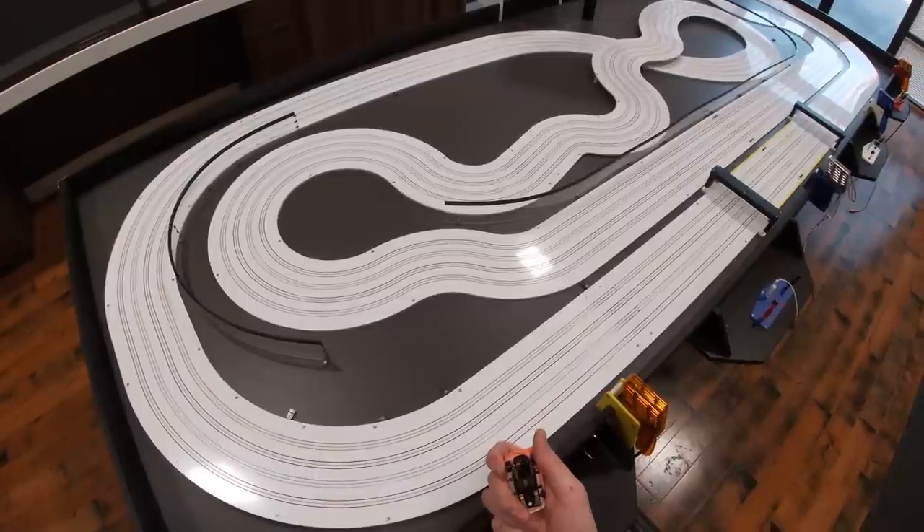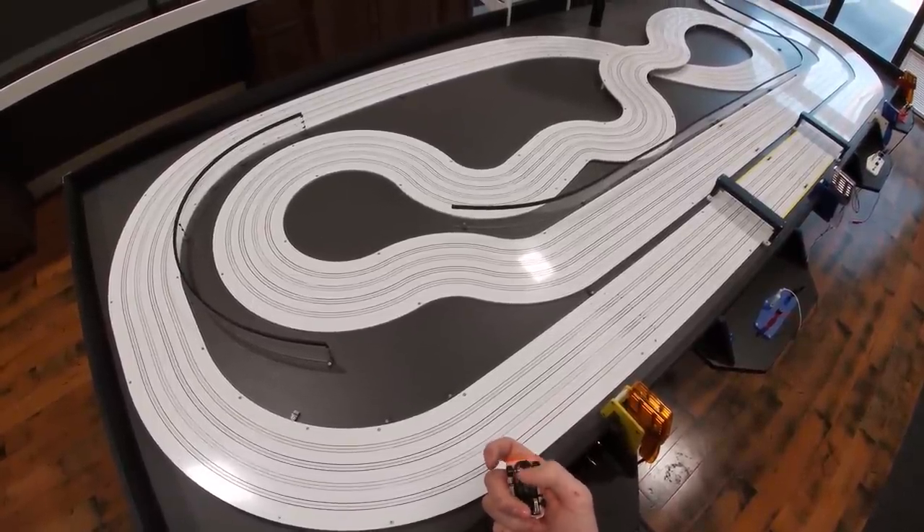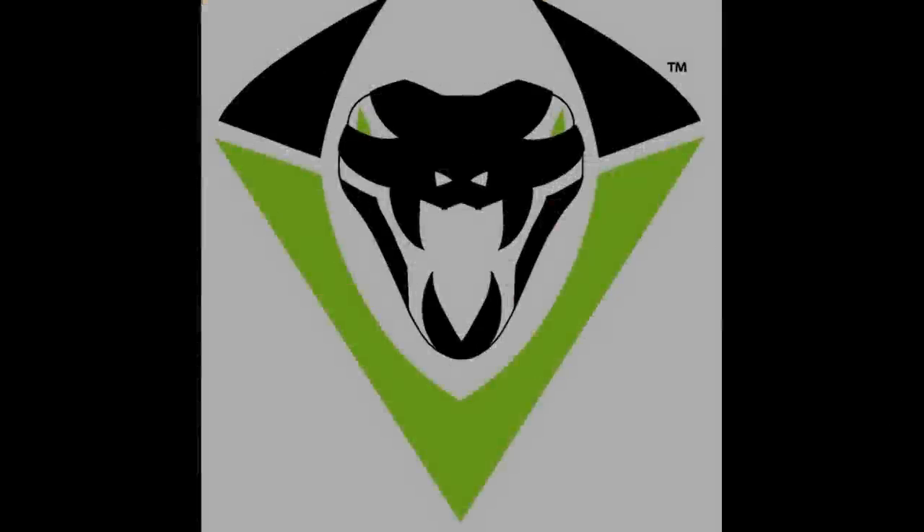These cars start at $49.99 without the body and they're built to spec just like we did here today. That's it for the video. Wrapping up: today we built a 12-volt Viper Jet brass weighted car. I'll put the tech sheet and setup sheet for this car online when I post the video and you can check out all the parts. This car is exactly how it would come from the store — same tires, same chassis, everything ready to run. Our track is about 15 thousandths rail height, 17 thousandths wide, and it's a 56-foot lap. We went 4.09 on it; 4.10 and 4.20s were really good, comfortable laps. A well-performing car right out of the box. Hope you enjoyed the video — see you next week!